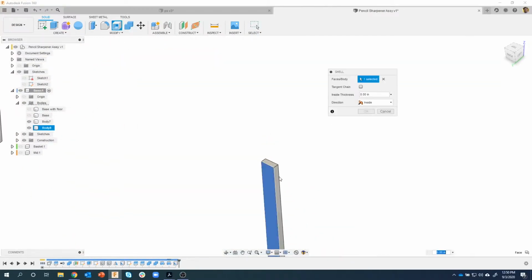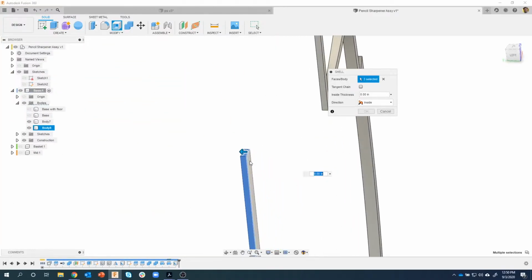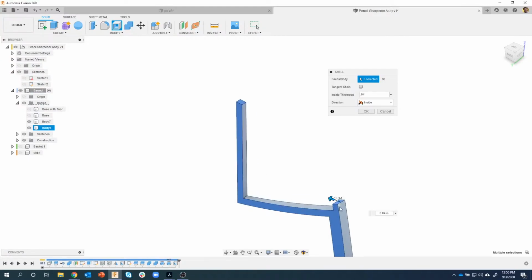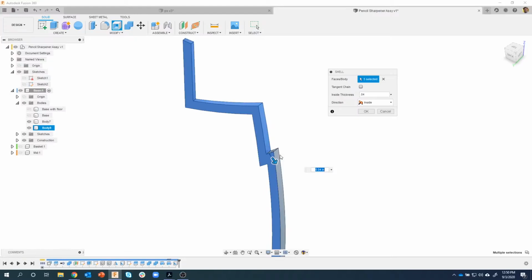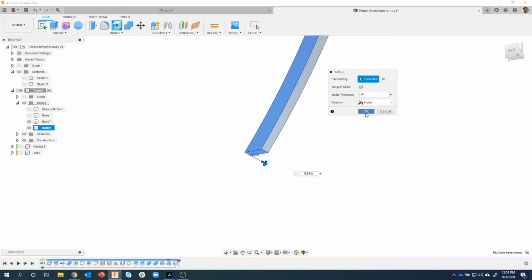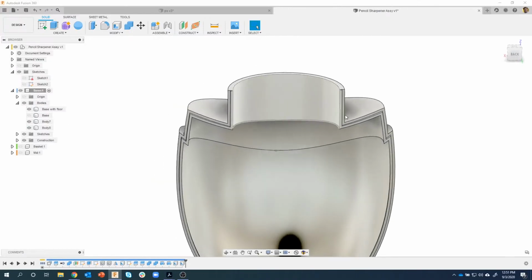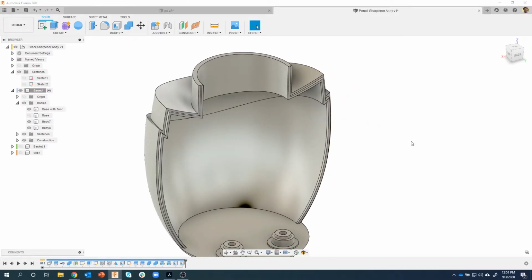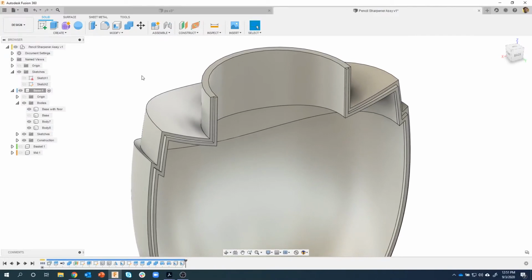I'll say shell, grab these top 4 faces to start things off, and then type in the 0.04, and then I just add in these other faces. Let me control-select that guy, that guy, and then the bottom face. Okay. We'll turn the base back on, and we can see that we now have this. I could have probably mirrored this one over to the other side since it's symmetric. I totally could have done that. But I wanted to show this process, and you can play around with it. Again, I put my outline in the description of the video, so if you want to try this out, feel free to do that. I also included the drawings to create this model.